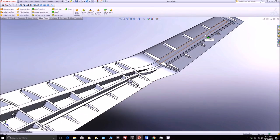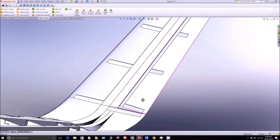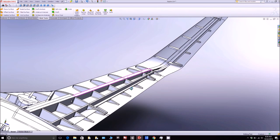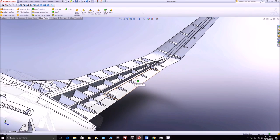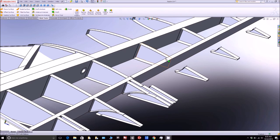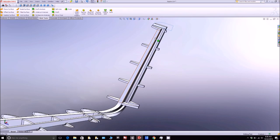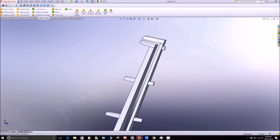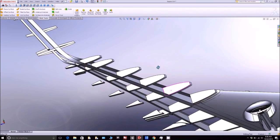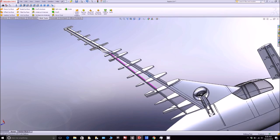There's a flap area we'll use on the prototype to see how that works out, and you can see the internals of the rudder — keeping it clean and simple while maintaining the necessary structure. All of this has been run through Mark's FEA analysis to make sure it'll handle all the loading during flight. With the skin completely removed you can see all the ribs, the main spar, the secondary spar, and the winglet rudder spar. Still to do: adding the wing fence and making changes to the foreplane, as we've decided to go with a slightly larger foreplane for the prototype since there wasn't enough lift up front.